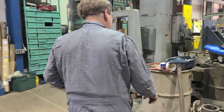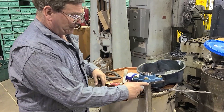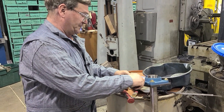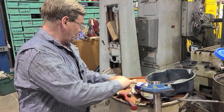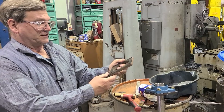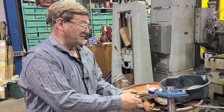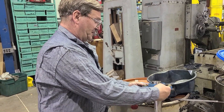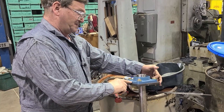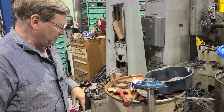To be able to center it — this particular one here — the plate is tapped and the holes for the bearings, you can see part of it here. They're cut way out to a larger square, just like these ones here. You could bolt through and have movement too. Somehow you need it so that when you bolt them on, you have movement. If you're using an indicator, it's real common to put some set screws or set bolts to be able to carefully and easily move your bearing around as you need to get them lined up.